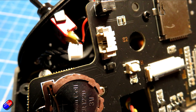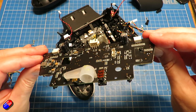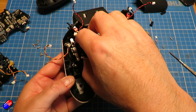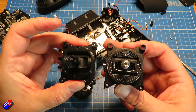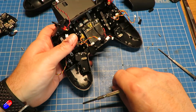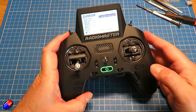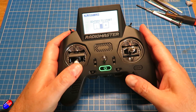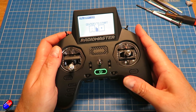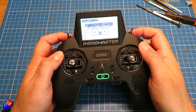Lots of the cables are color coded and the PCB has legends on it showing where everything plugs back in, which makes it a lot easier. Once you've unplugged everything including the ribbon cable — the ribbon cable connector just lifts up and you slide it out — you can pull the PCB out of the way and get to the gimbals themselves. They're held in place with four screws. Screws are supplied with the new AG-01 Mini gimbals but I didn't need them; the original ones were long enough. Once done, retrace your steps to reassemble, and I recommend rerunning the calibration routine in EdgeTX to make sure the radio knows the center stick positions. Be super careful about which is the horizontal and which is the vertical sensor and where it plugs into the back.